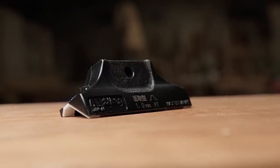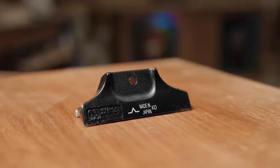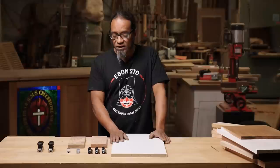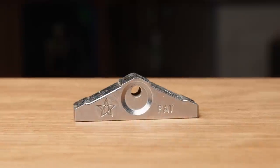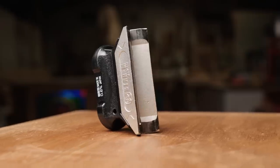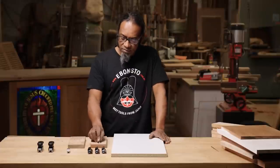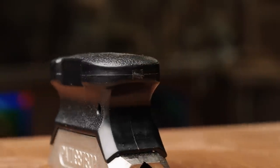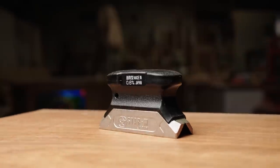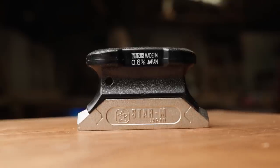We have three types here. One is the ceramic type which has a ceramic cutting blade, very handy for ABS edging, PVC tape etc. Then we have two steel types here and they have a steel blade which is also resharpenable. You resharpen it just by rubbing it on your sharpening stone. This one's called the grip type — it's just a bigger version, more ergonomic in your hand, and if you have to do a lot of this stuff this might be a bit more comfortable.